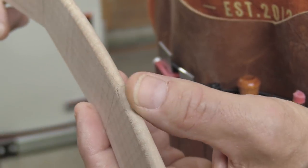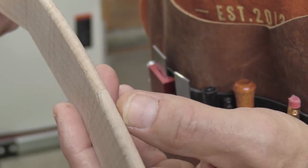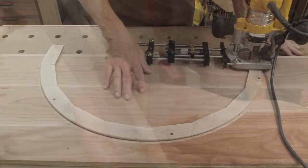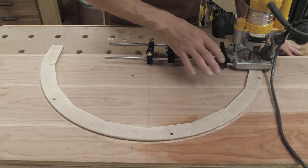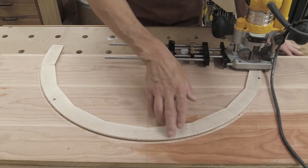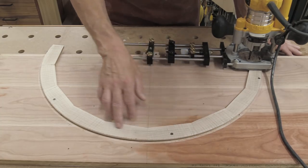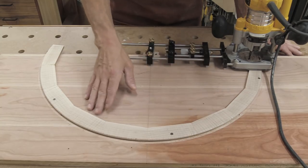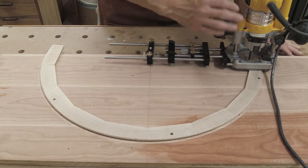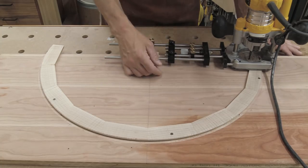There's the completed bead — it came out really nice. Just a little bit of sanding will take care of any rough spots. I'm back at my jig here. I've got the router set up to cut about an inch and an eighth from this edge. That'll give me plenty of room to move it around a little bit as I see fit, but I just need to get rid of all the excess on the inside. I'm going to do it the same way as before — do a sixteenth inch climb cut and then go back and cut the rest of it out.